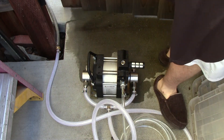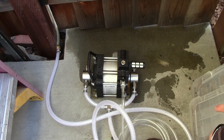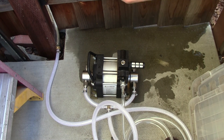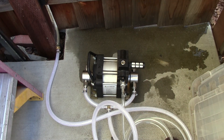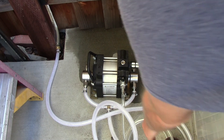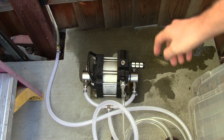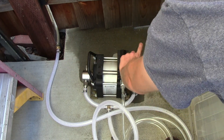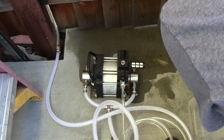What about the control? On this end we'll have a three-way valve where the open end goes to the air and is normally open to vent. When I send a closing signal from the Arduino running GRBL, it will open up and allow it to start pumping. When it stops pumping, there will be pressure stuck inside the high-pressure line at the orifice and cutting head — it won't want to go through the orifice and will want to compress the piston backwards. So the pump will try to backpedal, and the three-way valve gives it somewhere to vent.